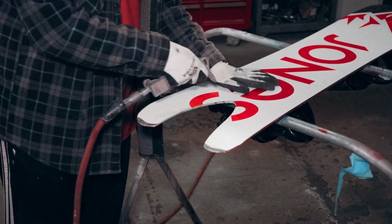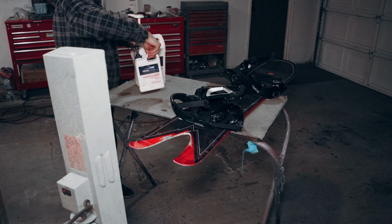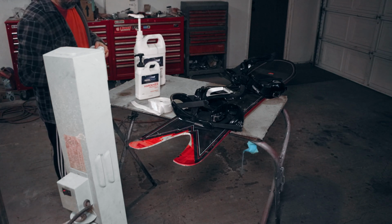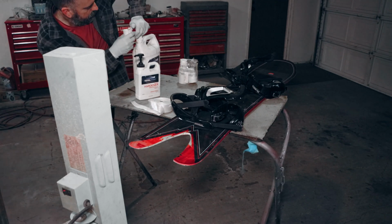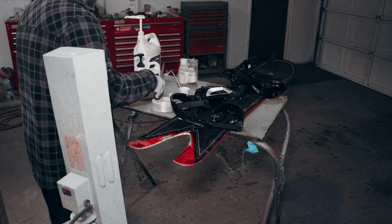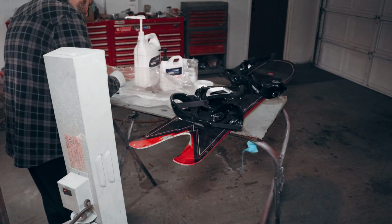We're not done yet. I'm going to take the extra step of sealing the edge with a piece of fiberglass and some epoxy. I do a lot of fiberglass work here and there, so I happen to have it in gallons, but you can just get away with a little part store tube. I'll mix up my epoxy. Get a length of fiberglass cut, and I'll lay it out on some throwaway plastic. I'll use an acid brush to soak the fiberglass.